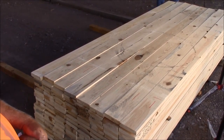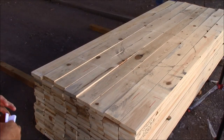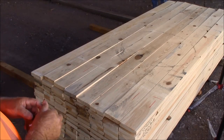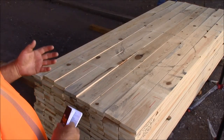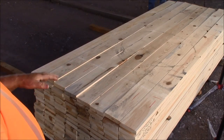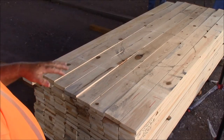We're looking for a number of different things. First off, we start with finger joint. Finger joint cuttings are cuttings that are to be finger jointed into longer pieces and then manufactured into different paint grade type moldings or other products. Finger joint moldings have to be 10 inches and longer, and free of characteristics except for stain. We try to minimize the stain to a lighter degree so when the finger joint material is primed, it will actually cover the stain — it won't telegraph through.